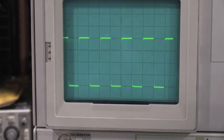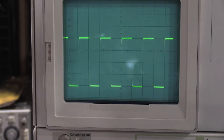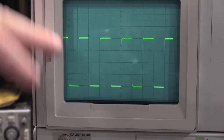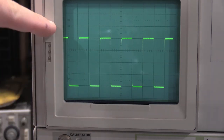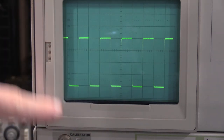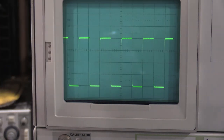Okay, well, I found the error. I've had the plug-in out for quite a bit tonight. Everything was checking normal. Everything was checking exactly like another plug-in. All the resistances were checking. Everything was matching, and I was scratching my head trying to figure out what was going on. Turns out when I did the quick cal to catch back up, I miscounted the divisions. I did the initial 5 millivolt cal to 5 divisions instead of 4 divisions, so that threw off the rest of the attenuator. So easy enough to do.